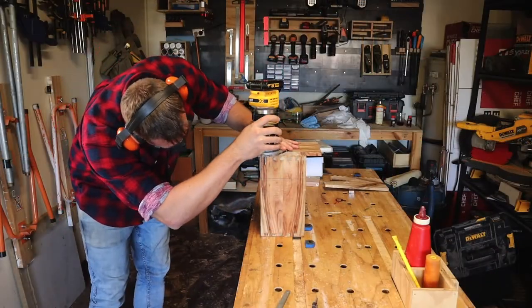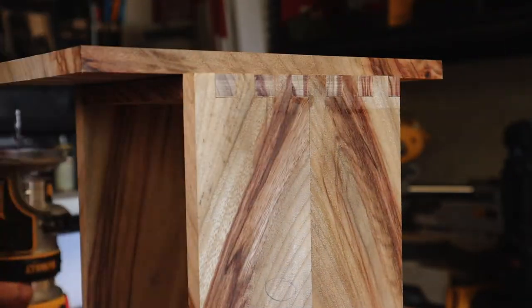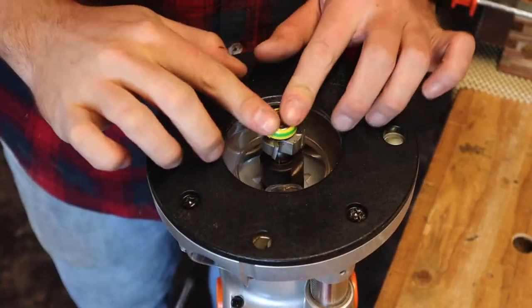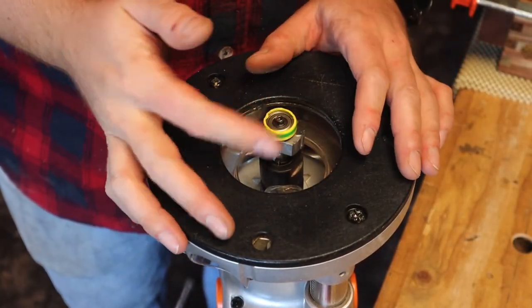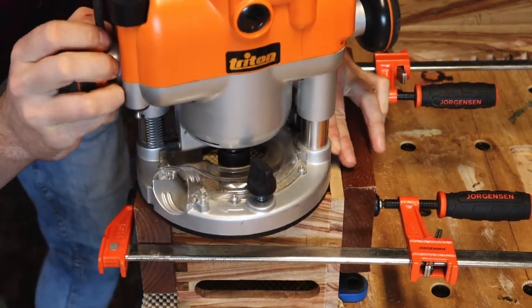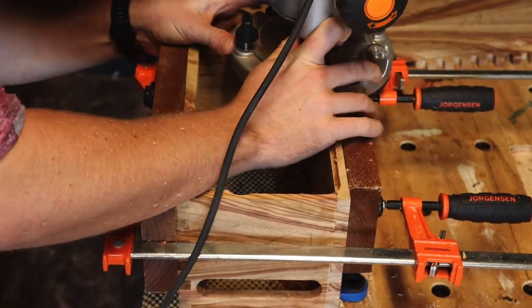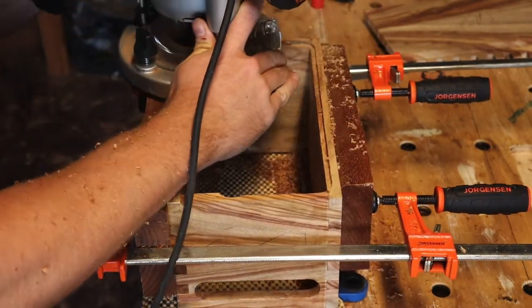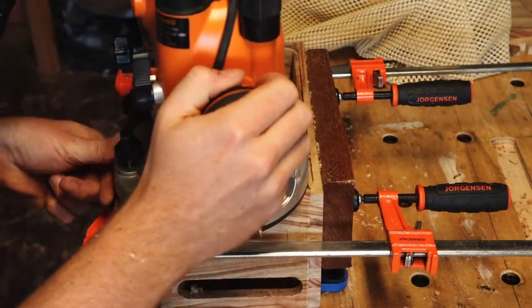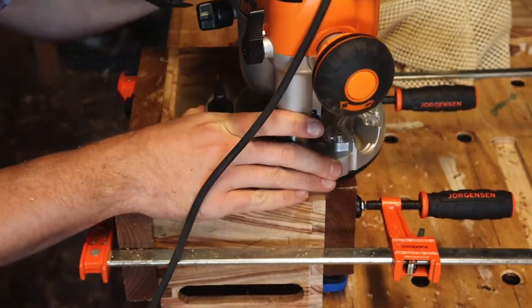Time for the router and flush trim combo to make its return to tidy up the joints. This next bit is super sketchy — I had to make the bearing on my rabbiting bit one millimetre larger with some electrical tape, before trying to use a plunge router on the narrow edge. Don't do it like this. I should have left the base larger and cut it to size afterwards, and I should have rabbited the bottom before gluing it up — or used a router table, but I don't have that. Learn from my mistakes and do a better job.